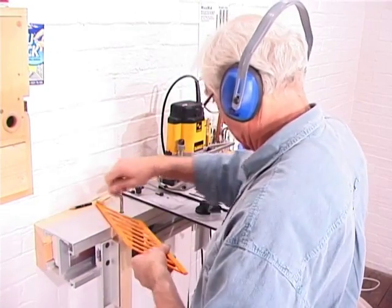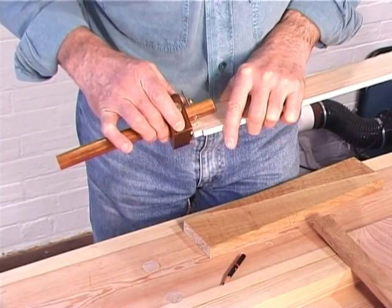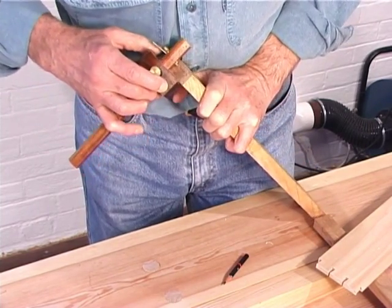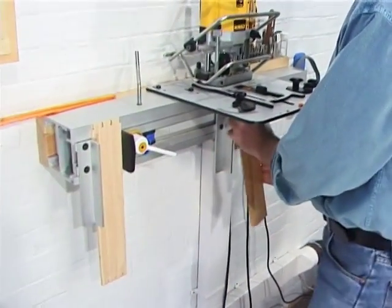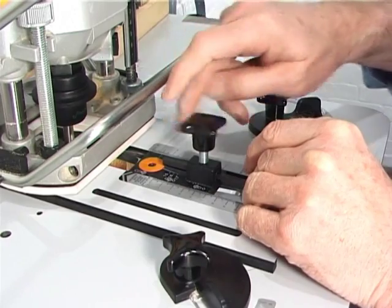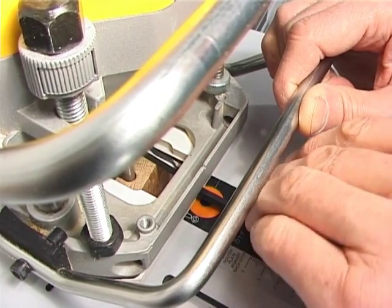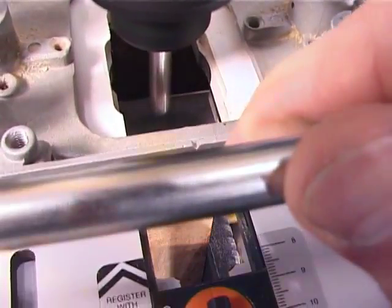Do the front tails first, then the back tails. With your cutting gauge, gauge the depth of the tails and transfer that depth onto the end of the drawer fronts. Place the larger Allen key in the center plate with the star knob in place. Now cut the drawer front pins in the same way as for through dovetails, but as you come forward to the scribed line, tighten the knob. Now you can cut the pins using the drawer side with tails as a template as usual.